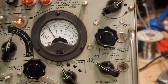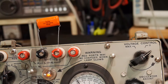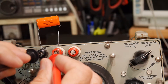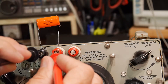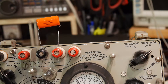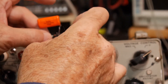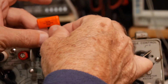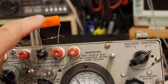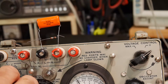What I'm going to do is create a bad capacitor. I'm going to put a 1 megaohm resistor across it — but first I need to make sure I don't have voltage on there. The voltage is bleeding off. I now have 50 volts, bleeding down. Now I have 25 volts — I'm okay touching 25 volts. So I'm going to attach this resistor, bending it around the leads. I've now put a 1 megaohm resistor across the capacitor.